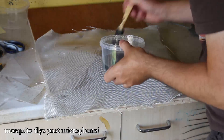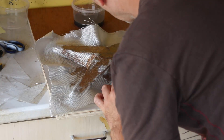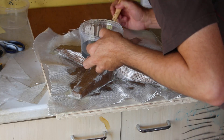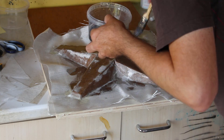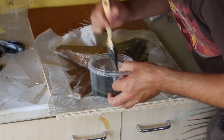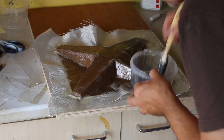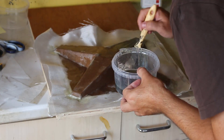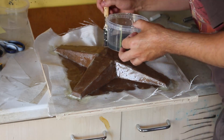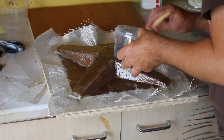This is an experiment — I don't know how successful it's going to be. I've kept the design relatively simple, but if it works quite well you could go for quite extreme designs. This is a lazy way to do fiberglass. If you're doing it properly you'd make the item as a pattern, make it as best as you can, then make a mold using that pattern, clean up the mold, and then make the finished article using the mold. You have to work quite quickly — try not to get any creases. So we're now going to put the tissue on.